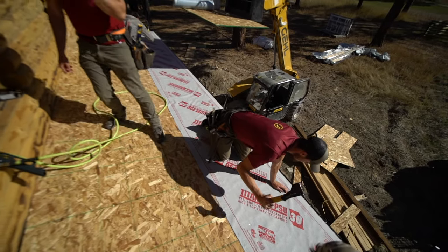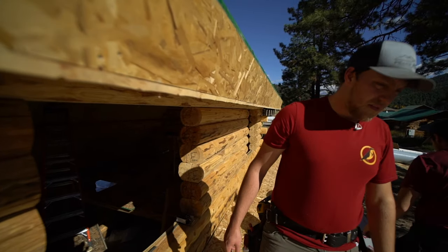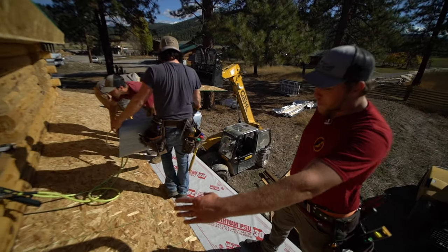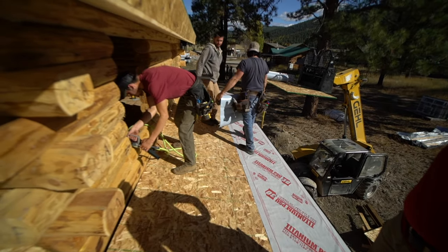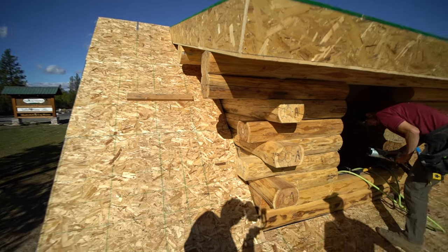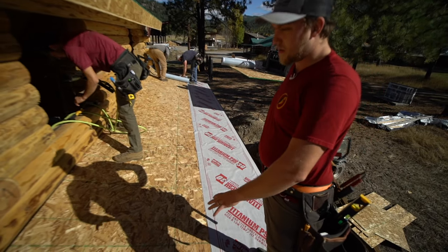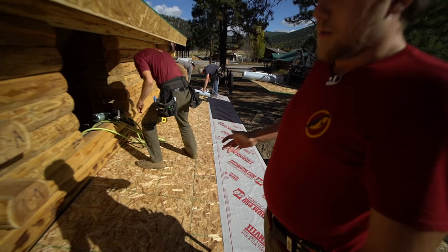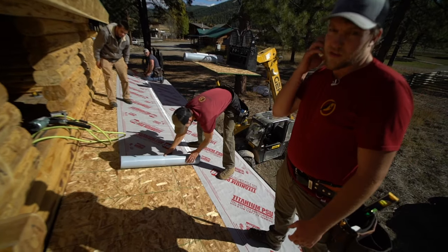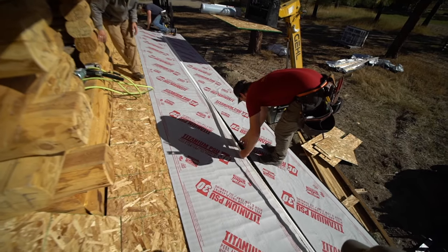There you go. So, the same thing again from that side, and as soon as we get to the, we'll basically cover the porch all the way with this, and we'll do our false overhangs with our other product, which is just a little thinner, a little easier to work with. So we'll do this with this. We'll do the false overhang with our titanium. It's also titanium, but it's an ice and water shield versus just a regular roofing underlayment. Make sure to overhang down to that line.